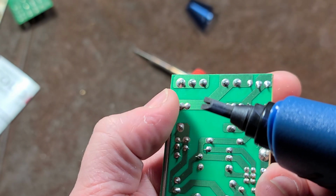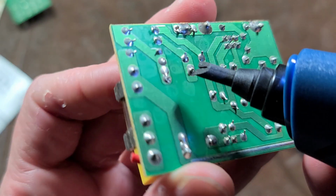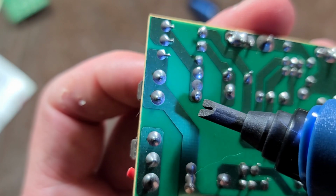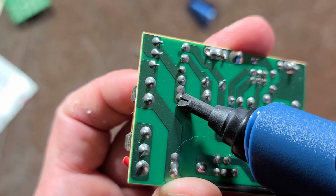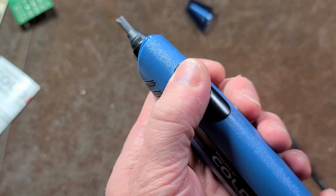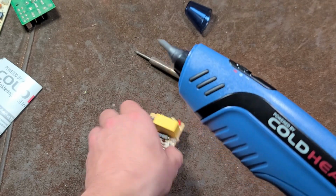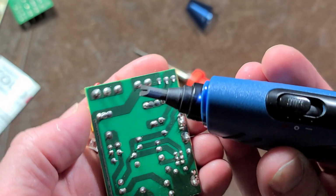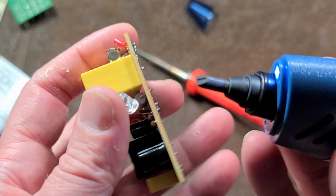It's funny, I'm getting smoking, yet the solder joint just doesn't have any heat. We can try this other side again that I was using, but once I got that leg partially pulled through, now it's trying to deliver all the energy through that glob of solder and just can't heat it up. And that's on mode 2, the high level. Something like this could potentially work if it were, say, 10.8 volt lithium ion, but once again, the other secondary issue is that you have live terminals, which isn't really what you want when you're doing electronics.